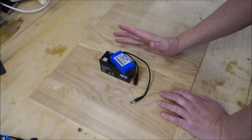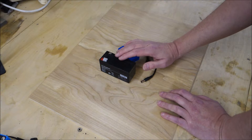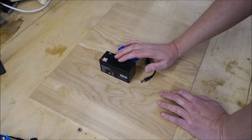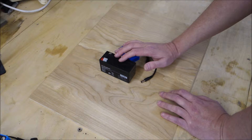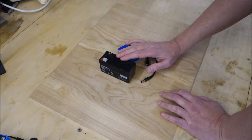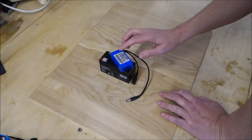That obviously greatly reduces the risk of damage. A lead-acid battery will actually stand a fair amount of abuse — I've drawn 10 amps from a little battery like this and never had a problem with overheating or catching fire. What tends to happen is they just fail very quickly: they'll go flat rapidly, and after a couple of times they won't hold a charge anymore. I've got one on the bench that's being recycled — although it's a 12 volt battery, it now only puts out about four and a half volts because the cells inside have been damaged. With LiPo batteries, you simply can't draw too much power — they won't let you.